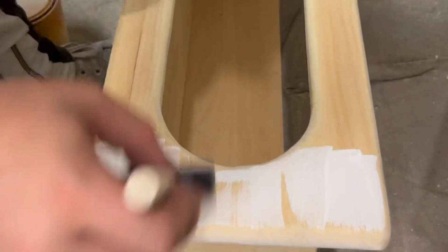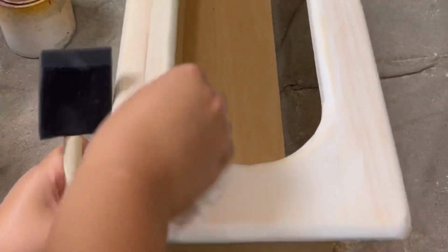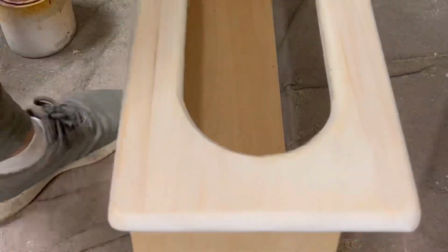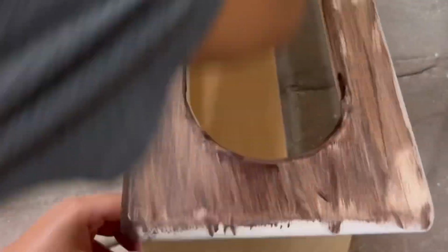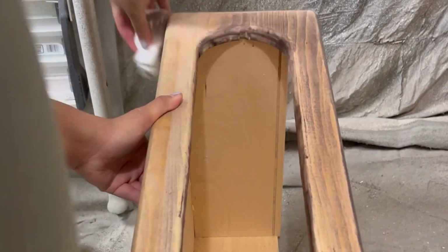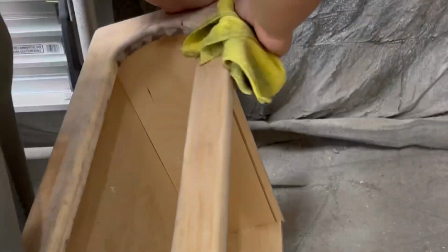We had an idea that we thought would look really good for staining. We were going to start with a white stain and layer it with a walnut stain. I think we might have messed up by using gel stain for both, but in any case, we hated the way the stains looked. Luckily, we were able to immediately remove it with mineral spirits. We let those drawers dry overnight before starting over on the sanding process on the ones we had used mineral spirits on.